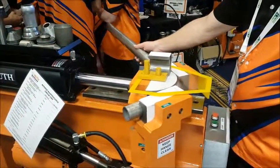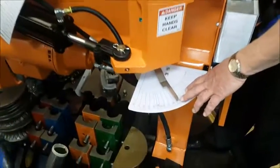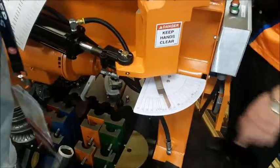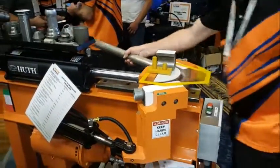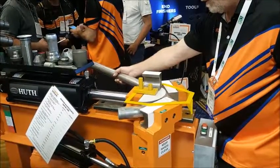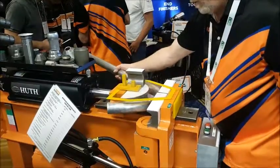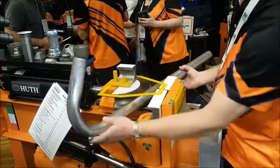Just like that, you bend. We're watching our degrees down here so we can see how far we're bending. Right now I'm at 100 degrees. I'm going to take this pipe to 120 degrees. I'm going to reverse it out. And it's a nice clean bend.